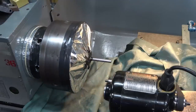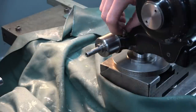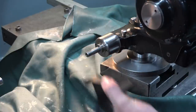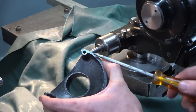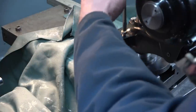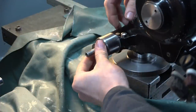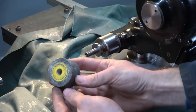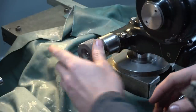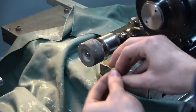Let's move on and look at the build-up of the wheel on the spindle. Onto this spindle I'm going to build my wheel setup. In an ideal world you put the guard on — it goes on there and this screw locks it down. A few people asked if this screw was a fine adjuster just for up and down — no, it's the screw that holds the guard on. However, I've got internal grinding to do as well as external, and this is not compatible with the internal grinding. So this is staying off. Onto the spindle goes a spacer, then my wheel, which has blotters both sides, then another spacer, and in goes the nut.